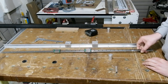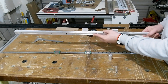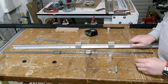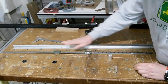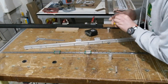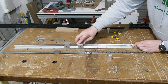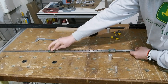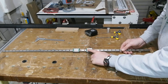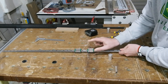I'm lucky enough to have two types at 1m length, left over from various past creations and tinkerings. A quick word on the two types: starting with these round bar types I'm not really sold on. They have their uses, but I find them not particularly smooth, and even when you try to eliminate the slop with the top and side grub screws in the bearing blocks, they still have play — even when the blocks are mounted to a thick alloy plate between two rails, you can still detect unwanted torsional movement. These square profile ones are different altogether. They're more expensive, but the bearing blocks slide smooth and have, by comparison, no detectable play at all. I'll be using this for the guide rail.